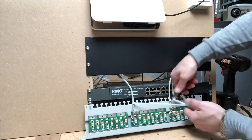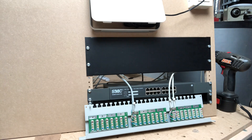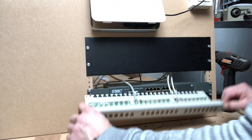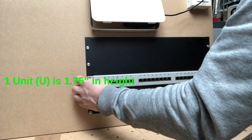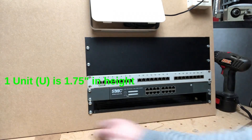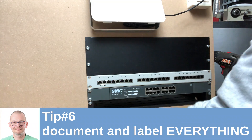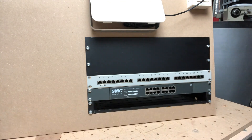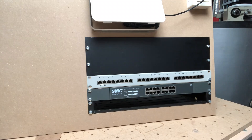When you use cable zip ties just cut them with a cutter, and when you put the patch panel into the rack you can fix it with the screws. When you put the patch panel in you might have trouble later identifying which cable comes from where. So, very importantly: label everything. Put a label on the patch panel that identifies the outlet in another room, and also put the number of the patch panel outlet onto the connector in the different room.